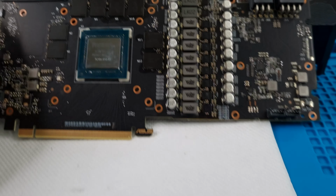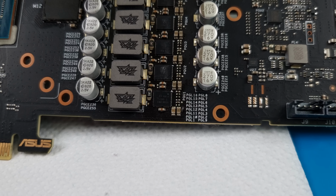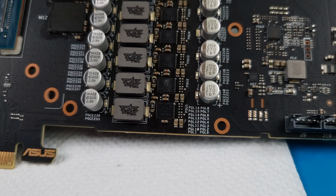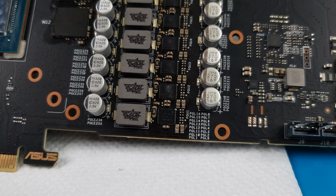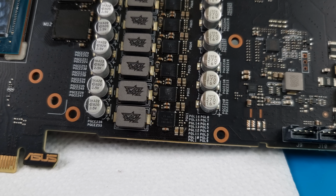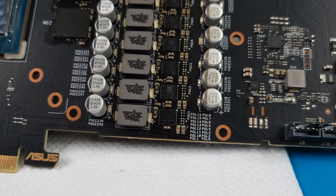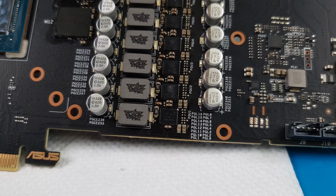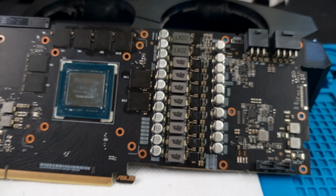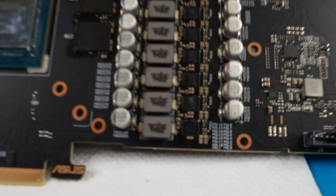Now, another thing that might be going on here is that as soon as I try and remove this chip here, we might encounter a case where the chip is actually welded to the board. In that case, typically I don't go any further than that. I just leave it as it is. But if it looks like I can repair it, like I can put some copper there or make up for pads or whatever, I will. But depending how bad it is, I'll just stop right there and leave it as is. So, okay, let me go ahead and get ready here and get this puppy removed.